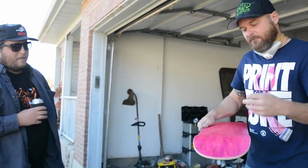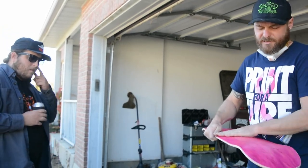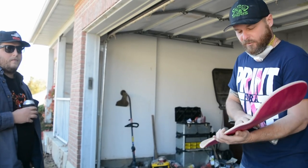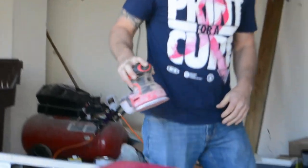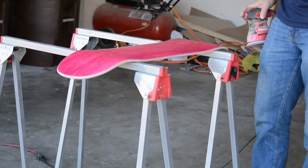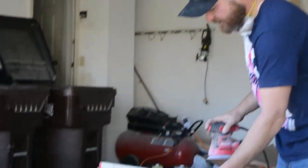I mitigate a lot of that by using alcohol, and it saves a little bit of time, but after the first coat of lacquer clear coat I put on, I still kind of have to go over it with a sander and re-clear it again. For screen printing, you don't want any of those little prickles coming up because it'll be like a spot that's missing ink when we screen print it. So I'm going to take 600 grit, sand this off real quick, and shoot it again.